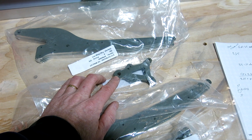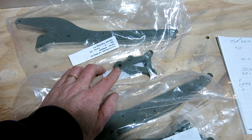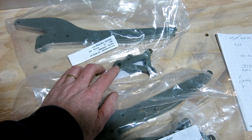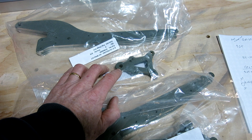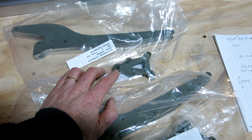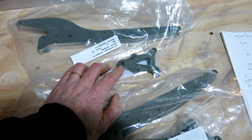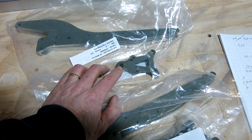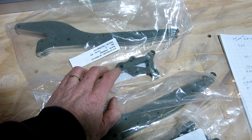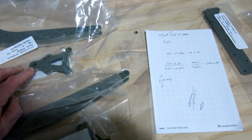The next step in the book says these get drilled or reamed out to five-sixteenths, because the flange bronze bushing has a three-sixteenths inner diameter. One thing that's explicit in the instructions is that when you insert the bronze bushing, if there's any play in the bushing, this part has to be replaced — you have to start over.